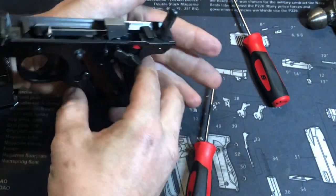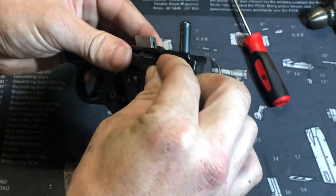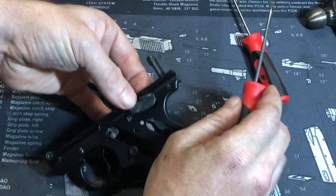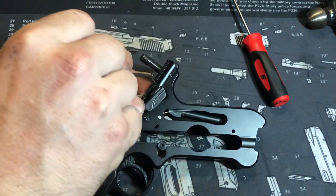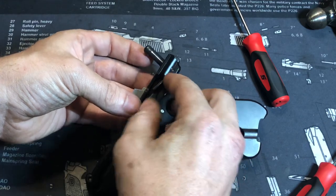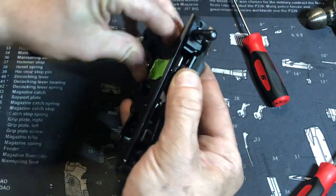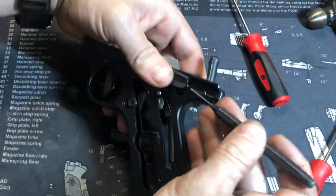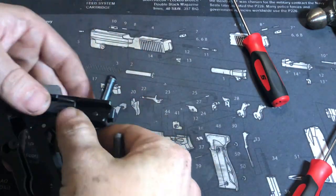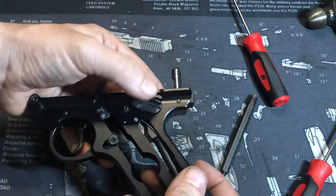Now that it's all captured, before you push the safety all the way through, get the detent ready and push it back in the back of the safety. Make sure the actual safety is up and out of the way so you can push the safety lever all the way through — it will just free-fall into place. Push it down as far as you can, make sure the detent is lined up, look on the other side, and push down. Push in on that detent, get the safety back up where it needs to be, and push the detent in while you snap the trigger and safety down. Now the safety should work.